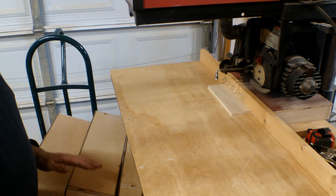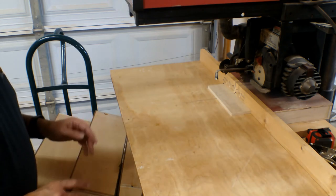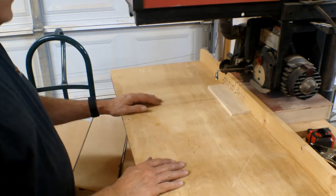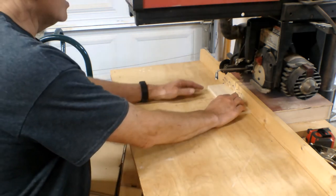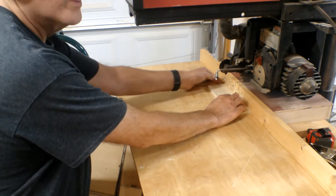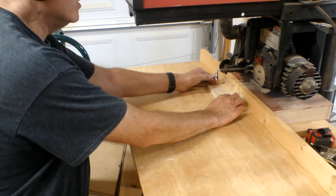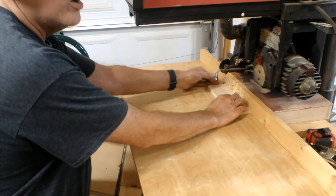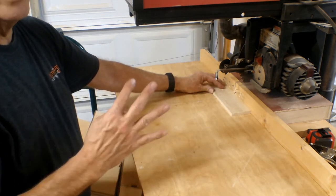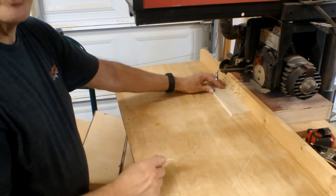Okay, I know a lot of folks out there who hate radial arm saws. Personally, I love them. I love them for this reason. I can see the work. I can see the track of the saw. I know exactly what's happening. What I've done here is I've taken these, lined up this edge by feel. Your finger can feel about 3/1000ths of an inch, sometimes even a little less. So these are all definitely on line. And now all I'm going to do is make one cut. It'll cut all four pieces exactly the same length. Let's make some noise.